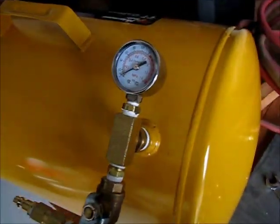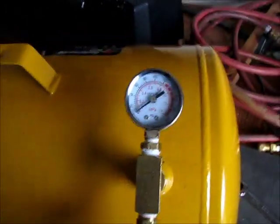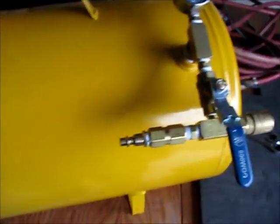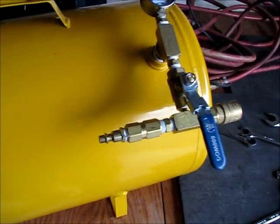And this is what I created. It's a little big, it's a little bulky, but it should work a little bit better. The magic is that little check valve right there — it should allow me to just pop an airline on there and fill it, then pop the airline off and it won't leak back out. So let's give that a shot.